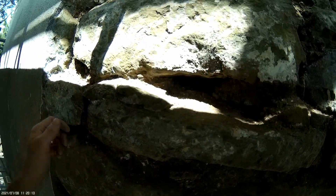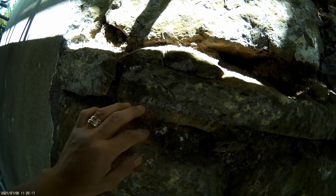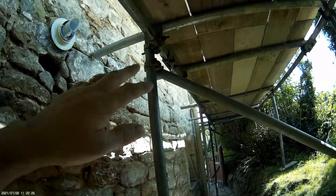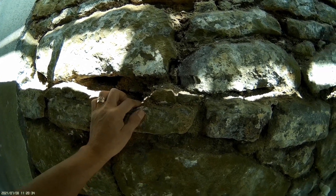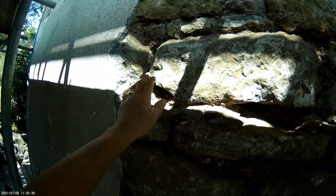Wire brush, toothbrush, etc. But I've got to chip some more off so I've got enough room to put some lime mortar in. The lime mortar I'm going to use is a ready mix — bought a one-tonne bag of it already and near enough used all of that. It's about three months old now, so it's getting a bit harder to use; you need a bit more preparation to use it, but it still works because it's covered with a bit of water.